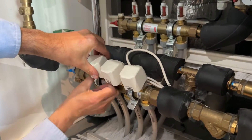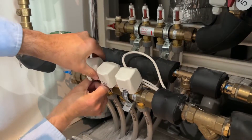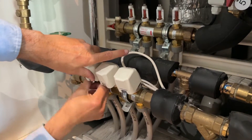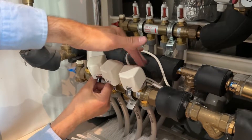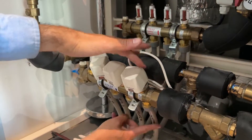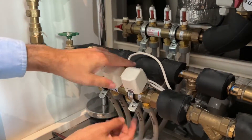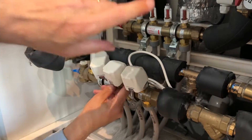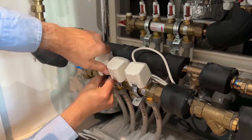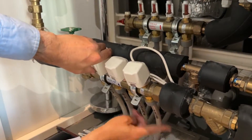Let's just reseat the last two — this is going in easily. Using the body to help. One thing for certain: if the actuators aren't labeled, just look at the gray pipe here. They're all labeled: living room, kitchen, bedroom one, and bedroom two. Each of those will have a thermostat — the kitchen one might be integrated. So if you do mix them up, you can just look at the gray pipes.